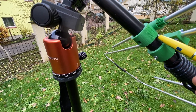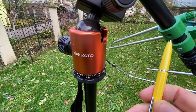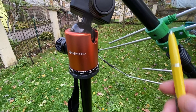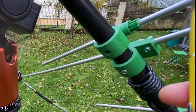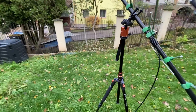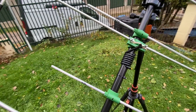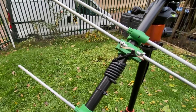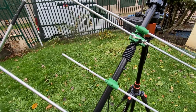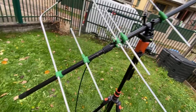In the end I may want to put a screw in and fix the element permanently once I find the best SWR position. The SWR on 70 centimeters — this antenna is cut for the SSB and CW portion of the band, around 432 MHz — but it's up to 2:1 also on the FM band at 436 MHz. For receive it works excellently.